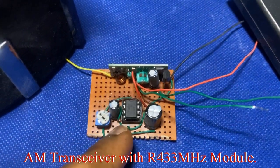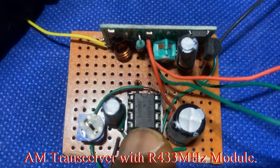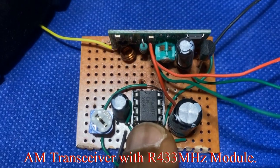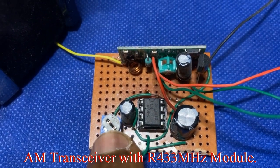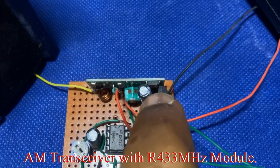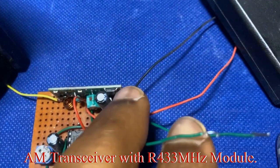What we did was connect the popular LM386 amplifier with two capacitors — one for the input and one for the output that goes to the speaker — and then the volume control. These are all we have here. You can also see a transistor and another capacitor, because these connect to the speaker directly.